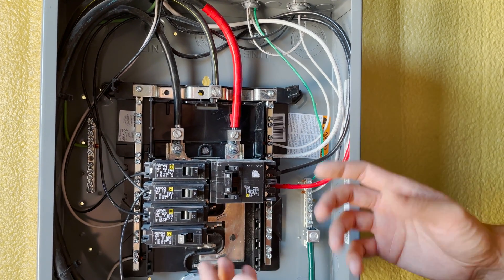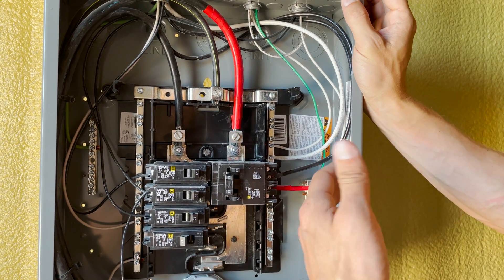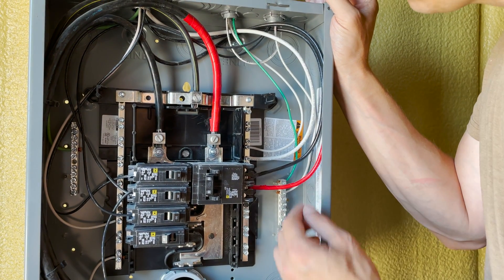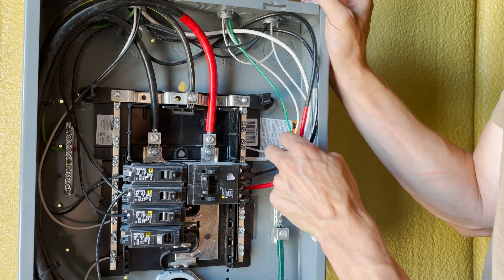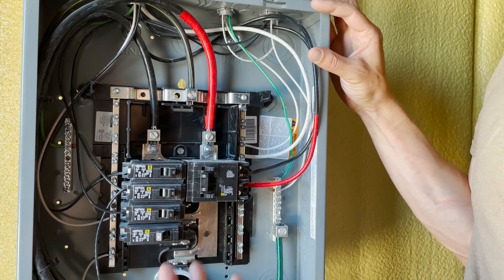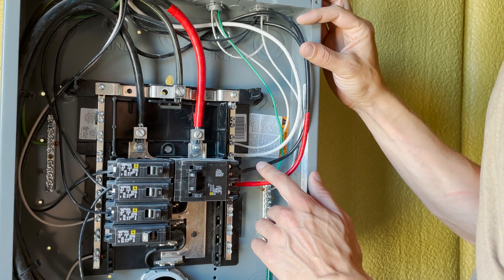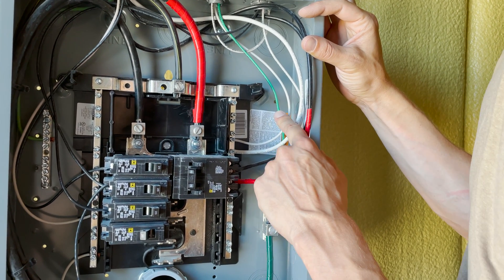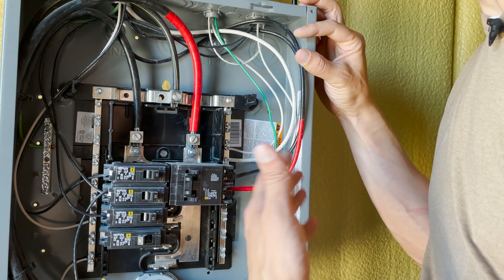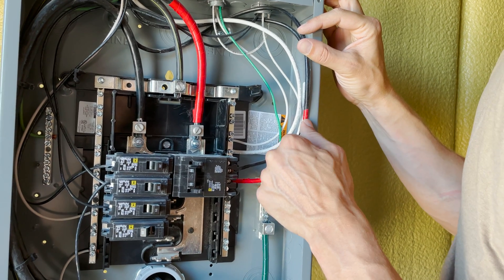Most of the time when you're doing wiring with 12/2, 10/2, or 14/2 — as we discussed in our ampacity video — you only have your two conductors: black and white. However, since this is THHN you just run an extra wire. The electrician who ran this only had black wire, so instead of running a separate red wire he took a black wire and wrapped it with red tape, but if you have the time and ability you can get a red wire. In AC systems: black wire is hot, white wire is neutral, green or bare wire is the safety ground, and red wire is typically your other hot leg — though it can also be a communication line or something else, but in this case it gives us that second hot leg.